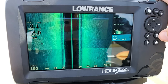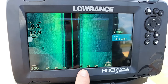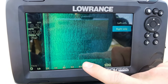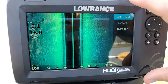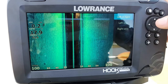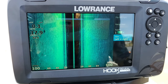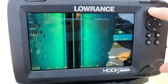The last option is view, which defaults to left and right — applying to both your left scan and right scan. You can change it to view only the left side or only the right side, or keep it at left and right. On older units you had to go in here to switch between side scan and down scan, but with newer software on these newer units they made it so you just switch it on your pages screen.